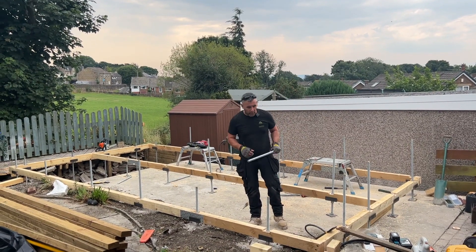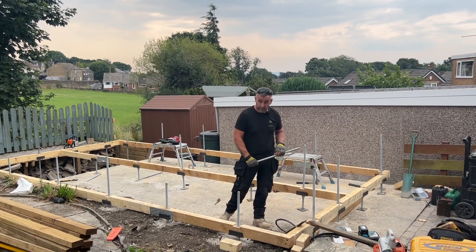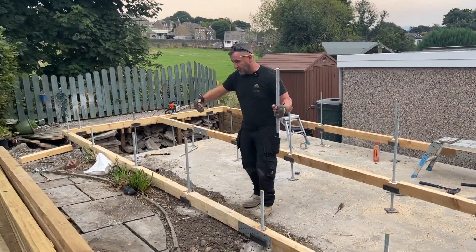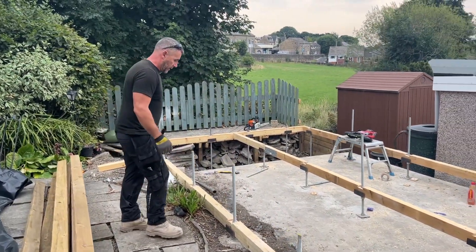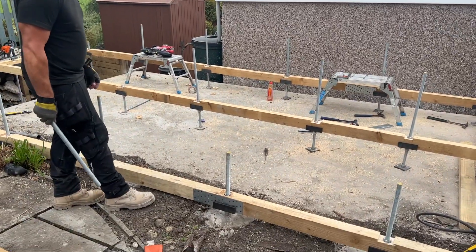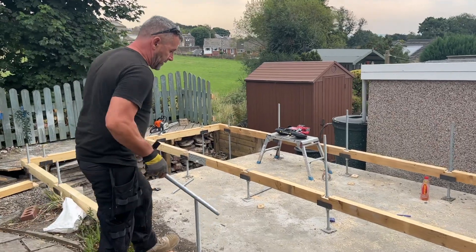Just a little video if you were in any doubt as to whether or not these rod systems were suitable for your build. This garden room has thrown a lot of challenges at us. This is the front elevation, where the doors are coming — the entry point to the garden room. She's already got a patio down there, so that's the optimum height. That point is the highest point of land adjacent to the building, so that's where we take our 2.5 from.